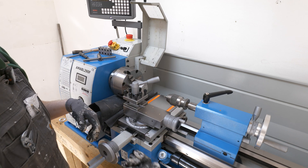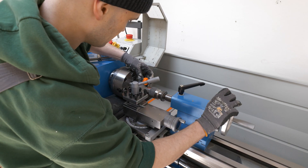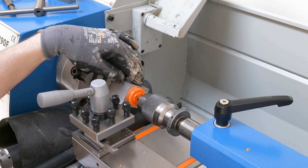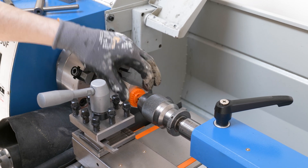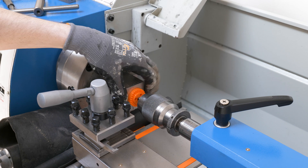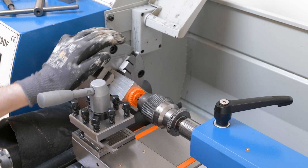First time using a keyless chuck as well and I really like that — it seems to be gripping the bits very nicely. I can use the 3D print as a guide. I've just got this eyeballed up and I've got the 3D printed part here centred so I can check that there's going to be material all around it. When I machine this away it should leave 35mm, which is what I need. I need about 20mm so I can just part them off as I create them — I only need two.